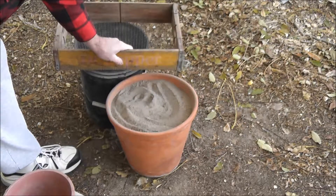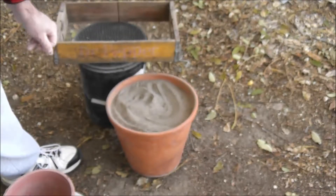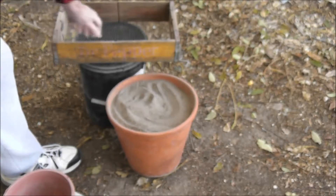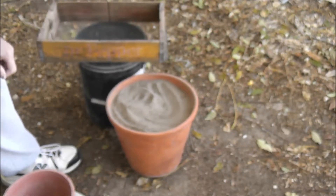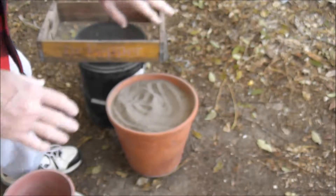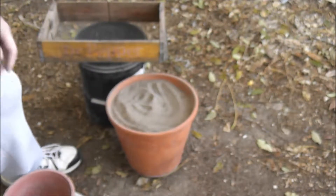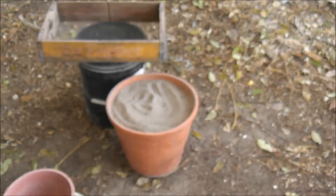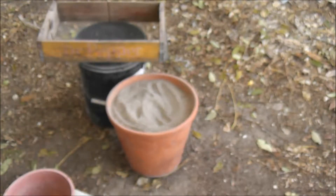This worked great. What we'll do is use the other screen — much smaller holes, this is great for this. I can see we'll be using that for a lot of things. We'll take at least half of it and re-sieve it. We'll probably get half a pot of finer sand. That way the impressions will be much finer — I just like a clean, neat job. Whatever it is in life, you want to do it the best you can, not the least that you can. Don't make it a habit of cutting corners — that's a very bad habit.